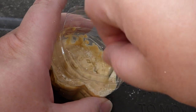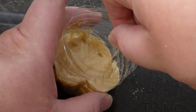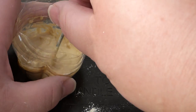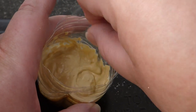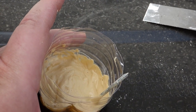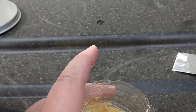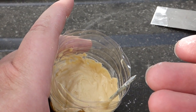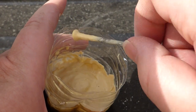We'll get this stuff ready and go up the ladder — I think this is about the right consistency. Depending on the dry time of whatever you're using, that's kind of what you want to mix up. I'm just going to do a little area right now. Later I'll mix up more when I'm doing more areas and find more areas to do. But whenever you work on something like this or a stucco patch, you want to look for the dry time or the working time. This stuff here does take a while to dry, and of course it depends on the ambient temperature and stuff like that too.